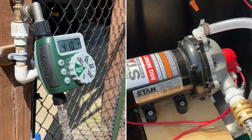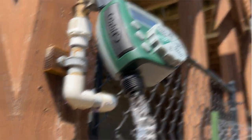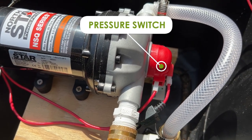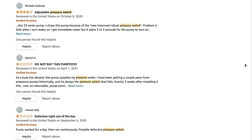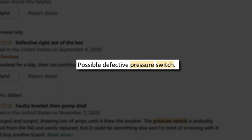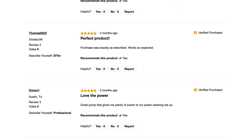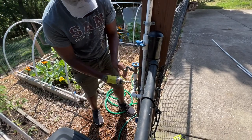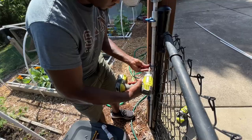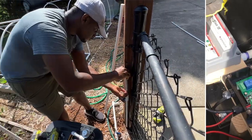As I mentioned before, this watering method could solve my issue. However, it requires that I leave power connected to my on-demand pump 24/7 and rely 100% on the built-in pressure switch to turn the pump on and off. From my research, several people have complained about built-in pressure switches failing over time, which could result in the pump attempting to run when the outflow path is closed or blocked, eventually damaging the pump. This pump I purchased had great reviews with few mentions of pressure switch issues, but I just prefer not to take the risk. So instead, I decided to redo my PVC plumbing so I could continue to remotely control my pump from my phone and create my own schedule using the smartphone app. If you'd like to learn more about how I set up this wireless feature for my pump, I'll leave a video link in the description below.